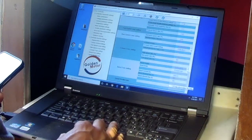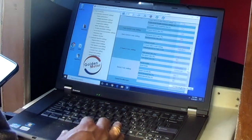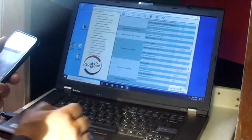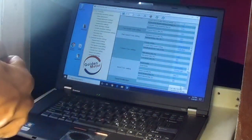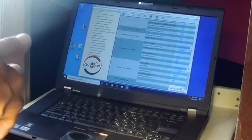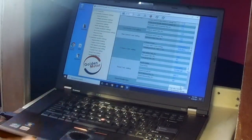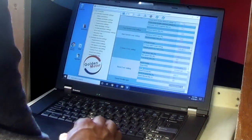Down here at the bottom under speed throttle type — and like I said this is the most annoying interface — you can either pick hall effect throttle or potentiometer throttle. For the joystick you want potentiometer, but if you were using a bicycle style throttle then you want linear and hall effect throttle. So this one here is a potentiometer type throttle.